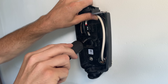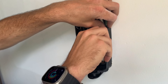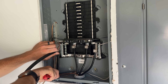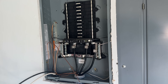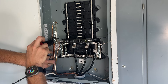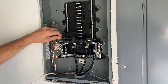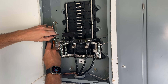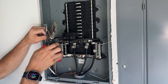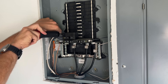I'll put red tape on the white conductor to clearly denote it as a hot conductor, not a neutral wire, and use a zip tie for wire management. Moving up to the sub panel, I'll remove the Romex cover and land our wires. Starting with the bare ground — and since this is a sub panel, neutrals and grounds are kept separate; there's no neutral for this circuit. Landing the 60-amp Square D QO breaker, I'll strip the first hot conductor, torque it down to 45 inch-pounds working the wire back and forth, then apply red tape to the white conductor and land the second hot into the breaker.